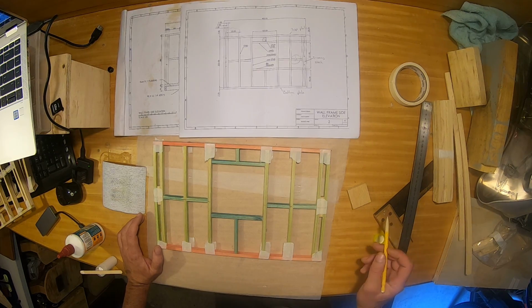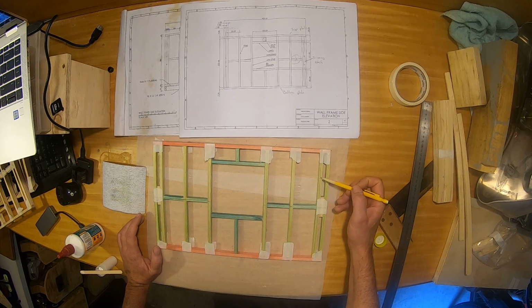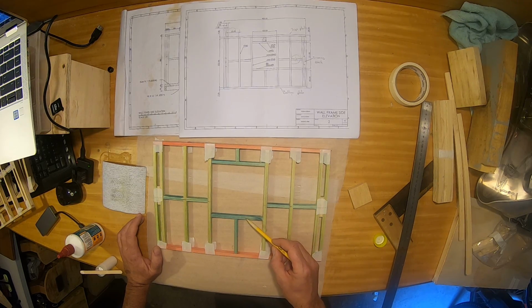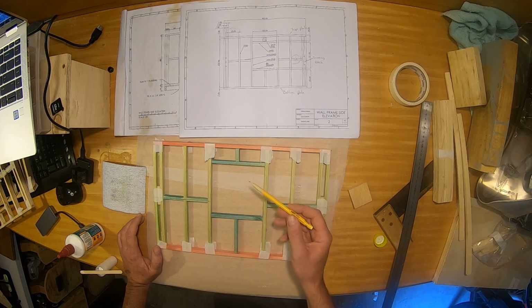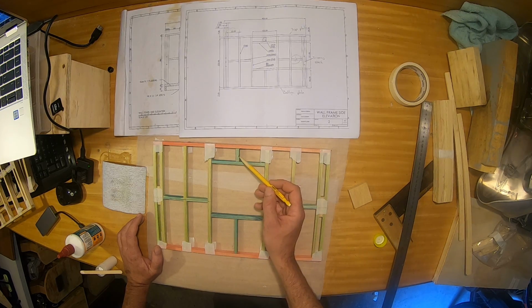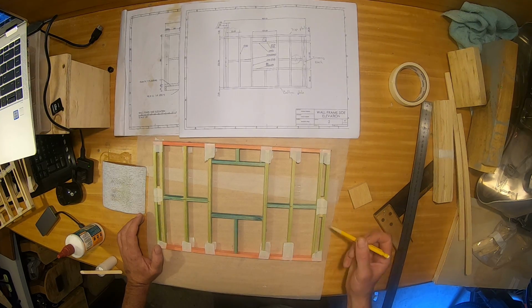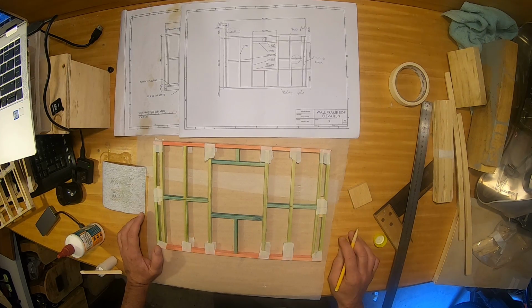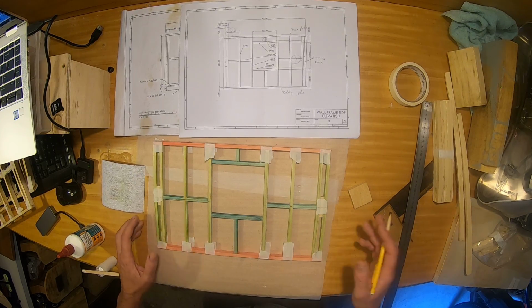And hopefully you've learnt the bits and pieces: the plates, the studs, the noggins, the sill trimmer, windowsill. Everyone knows what a windowsill is. So the sill trimmer is part of your windowsill. The lintel at the top, a support stud, and a jack stud up the top there. Not forgetting the 2 little trimming blocks here. There's a reason for those as well, guys, but I'm going to explain that when we're assembling the whole house together.